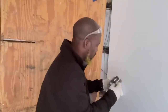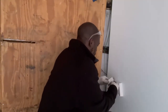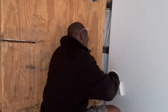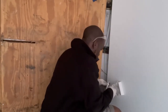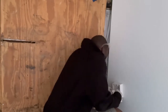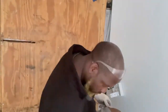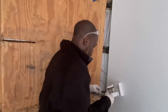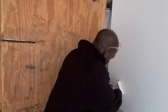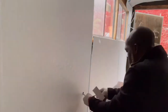For the outlet placement, the outlet has to be on the outside wall, so I have to install the FRP first before I can put in the outlets. I put in five outlets on each side, spaced out so depending on where the fridge, prep table, or hood is going, they'll be easily accessible. Remember, extension cords are not allowed in these trucks.